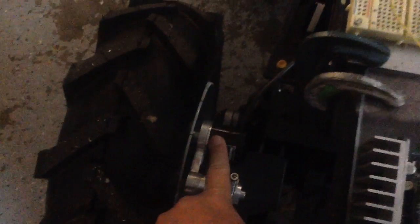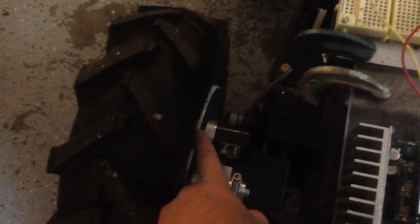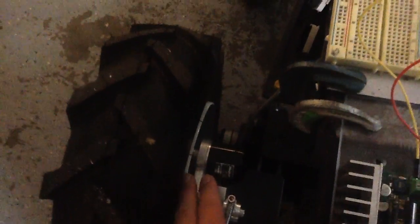On the other side I only have one rotary encoder currently — still prototyping. On this wheel there's a rotary encoder I picked up from SparkFun; it looks like a normal motor. There's a wheel on there that makes contact with the rim of the tire to pick up the motion and measure speed. I've got it on a little spring-loaded thing that pulls it up to make contact with the wheel. It's mounted where one of the fenders used to be on the Jazzy, so it had a nice mounting point. It's still prototype so I just have a wire holding the spring, but eventually I'll build a proper contraption to tension it.